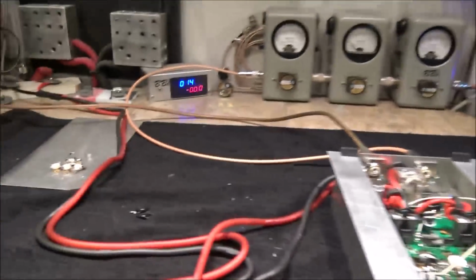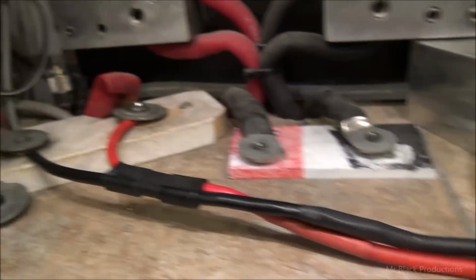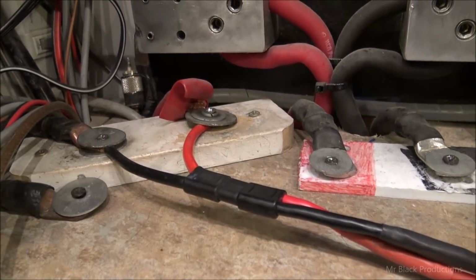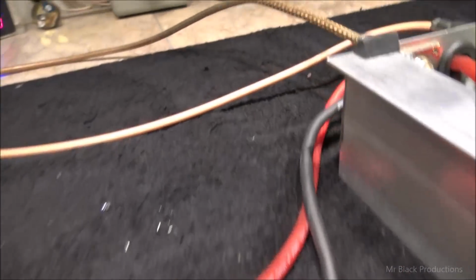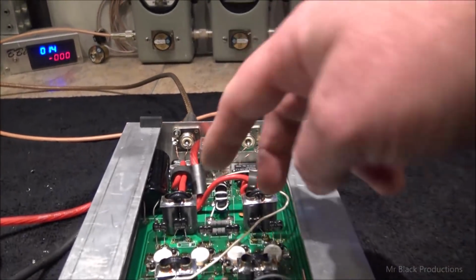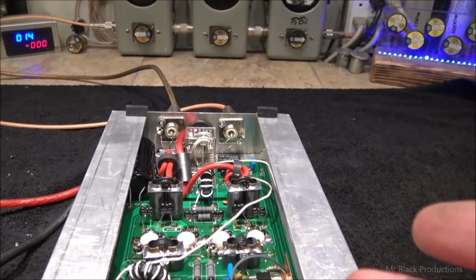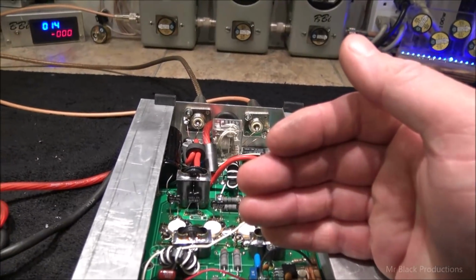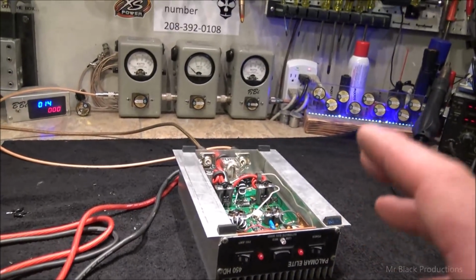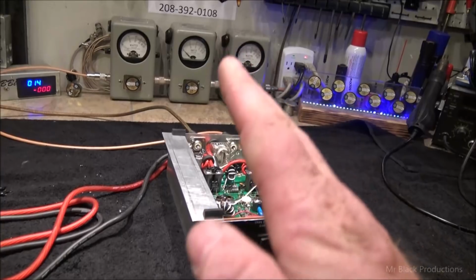And the other thing I was explaining to you, Mr. L, was that this clip doesn't do you any favors. Okay, but I'm going to leave this in line. And I strongly suggest that you go to Anderson clips. That'll help you save a bunch of amperage. For every one of these weak connections like this and this, by the time the amperage moves all the way through the cable and then comes down here to the board and then moves around, if we're feeding this 14 volts, by the time it gets down to the components, they're seeing like 13.2. So if we have the power supply at 13.8 or 13.5, the parts are actually running at like 12 volts. Yes, that's what they're rated for, but they run really, really hot there. They'll run cooler if you come up to about 14 volts and bring that voltage floor from 12 to about 13.8.